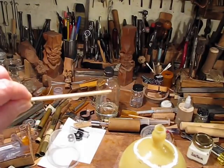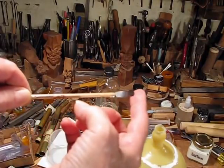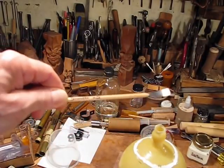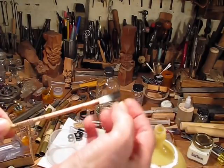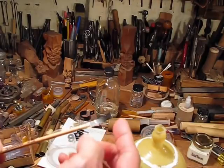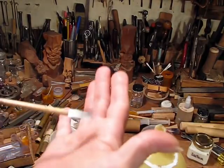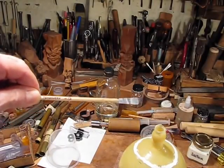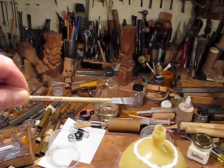This little tool I was using to smooth off the seam — this is a number two snouter. It's made with a piece of hardened shim stock, three thousandths of an inch. It's a nice little tool — snouter number two, available from Salomon Industries exclusively.